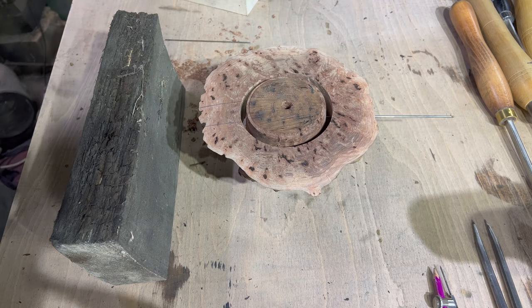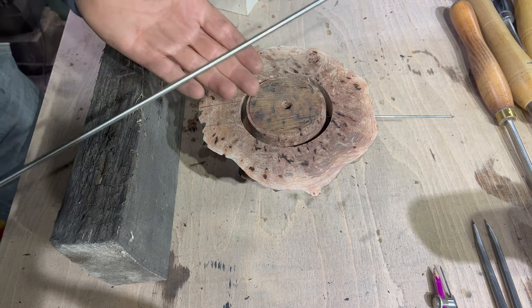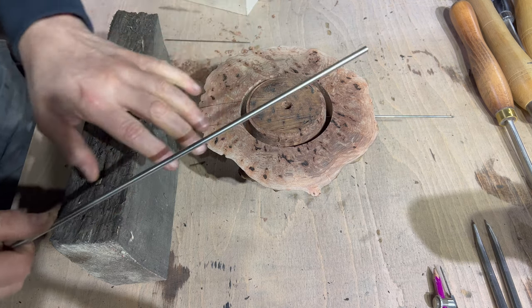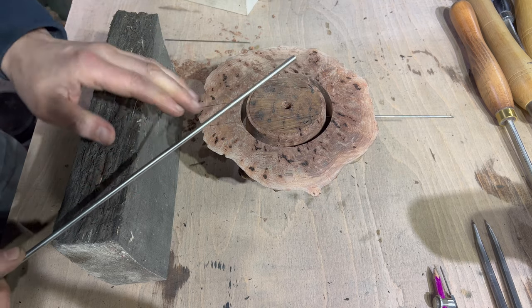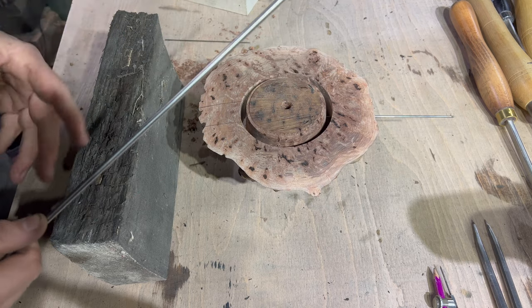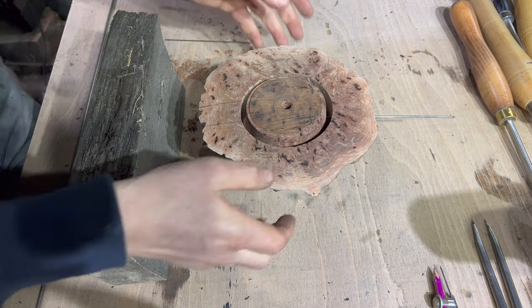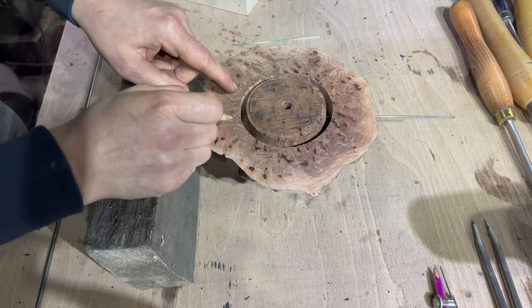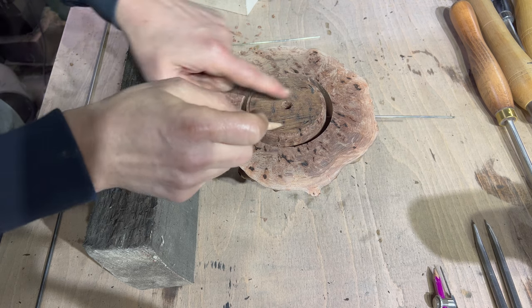Whee! For this one, because it's quite small, I usually use 8mm rod, but I'm going to use some 5mm stainless steel. It's a little more flexible, but they aren't going to be massively long. There shouldn't be an issue, and if there's two of them holding it up, no problems there at all. It's not like they're going to bend. About 45 degrees, I reckon. There's either side of the line down the middle.